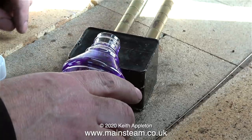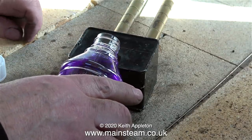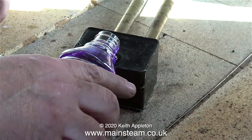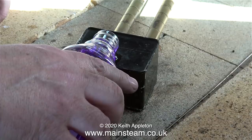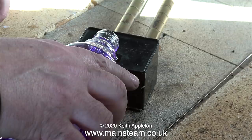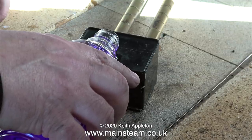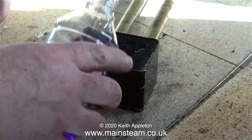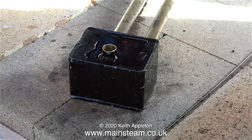Time to test it in the outer part of my workshop, on my brazing hearth. First, I filled the tank with methylated spirit, or denatured alcohol. But I overfilled the tank — I did this on purpose because I wanted it to be right to the top, and in a moment you'll see it spill out all over the top of the tank. Unlike with the other 504 and 501 boilers that I've had, this burner didn't work at all well — hence the experimentation to make it work better.